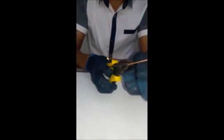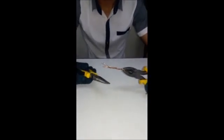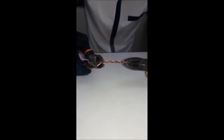Using the combination pliers, hold them together, then twist it about 6 to 8 turns. Then, using the long nose pliers, twist it together to tighten the joint. When you reach the edge of the wire, cut the excess wire using the side cutting pliers.